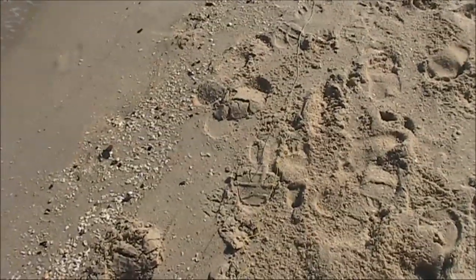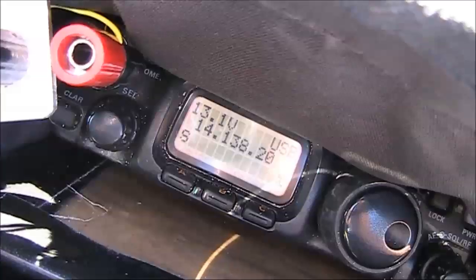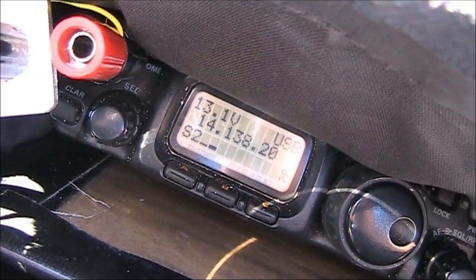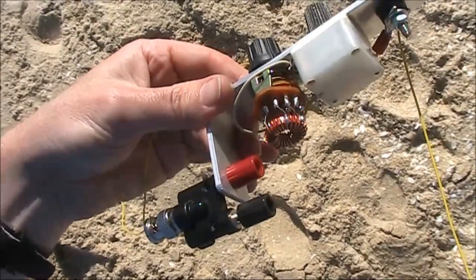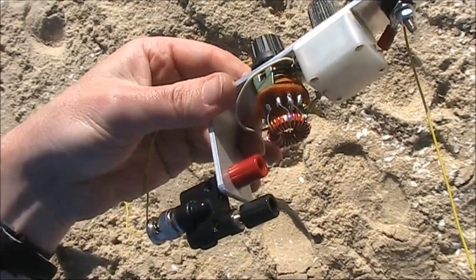The best radiation is in the direction facing the radio. Unlike the last few weeks, conditions on 40 metres are very poor and almost no signals are heard. So it might be time to do something different. I've swapped the banana connections, so the ground tuning unit is now in the antenna line, which may allow it to cover several other bands.